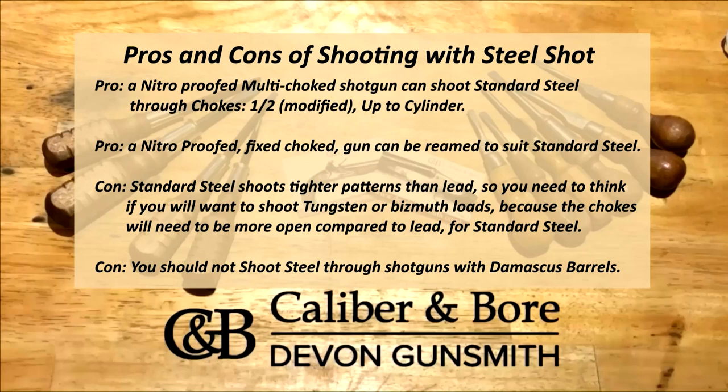And you may have heard me say more than once that standard steel shoots tighter patterns than lead. So you might need to think, if you want to shoot tungsten or bismuth loads, because chokes will need to be more open compared to those for shooting lead when you're using standard steel. And an unfortunate con, if you have Damascus barrels in your gun, you should not shoot steel through them.